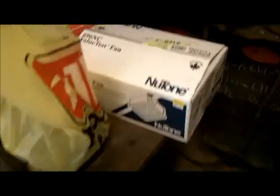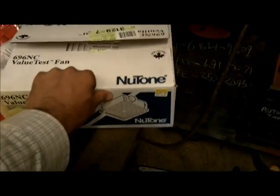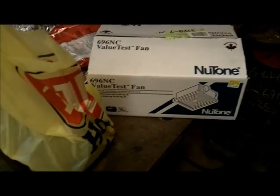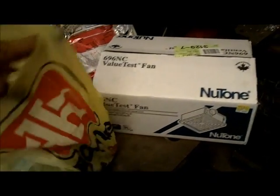We're moving on to the project now. I'm going to do a project that is just going to blow you away. If you don't have a forge and you're a young guy — or even an older guy — trying to get into this, I thought to myself: what is the absolute cheapest way a person could make a coal or charcoal forge? I got a bathroom fan. I know these work because I've used them before — it's a high volume thing, not a lot of pressure but high volume. Works pretty good actually.